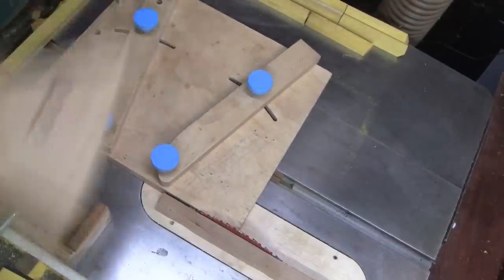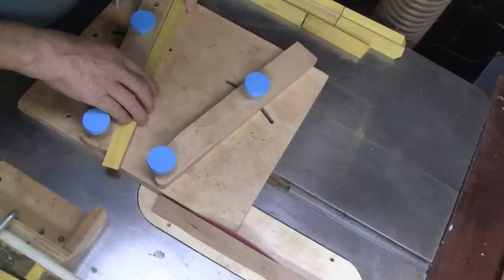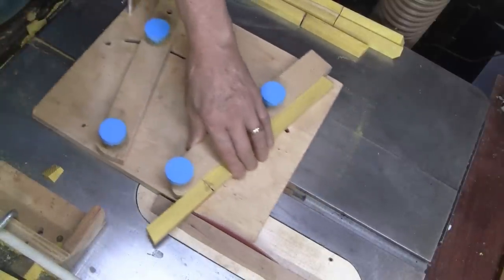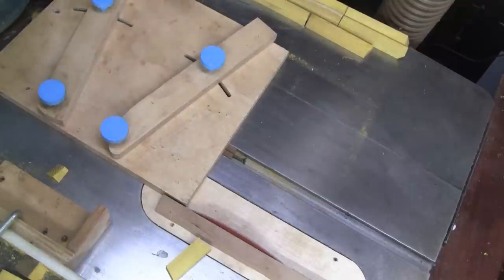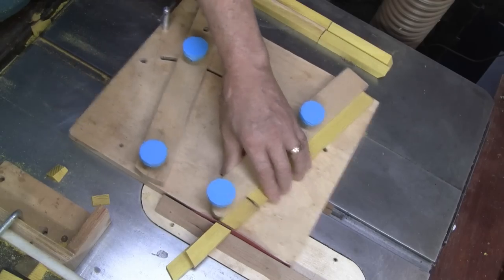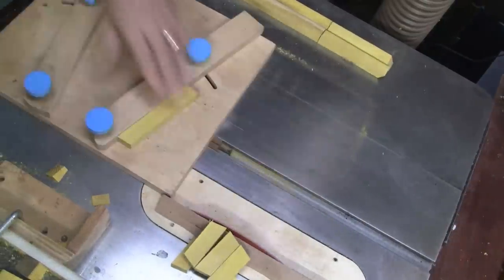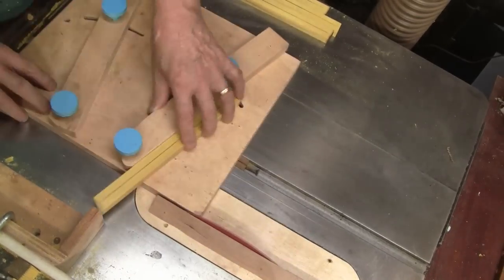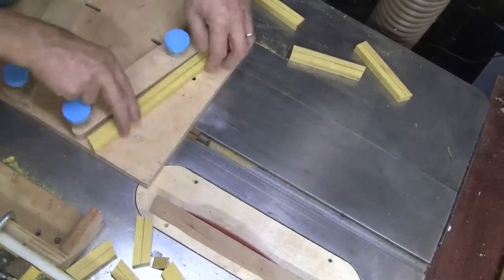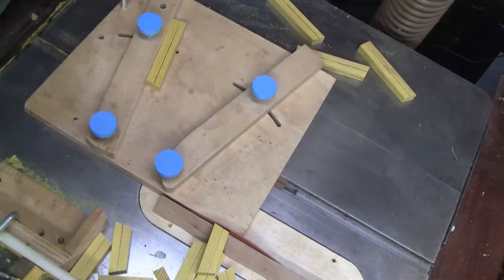I'm using 12 segments per ring. I played around with 18 or 24, but decided on 12 because it took less material - I didn't have enough to gamble with - and 12 will also space around the 6 very nicely. I hot glued the short piece to a longer piece, and once I cut that I use the long piece until it gets short, then may hot glue it to another. I put a pencil line on the top of each piece so when I glue them together the pencil line points up - if the saw blade was off just a little, you're cutting the complementary angle, because one piece is cut from the left side of the blade and the other from the right.